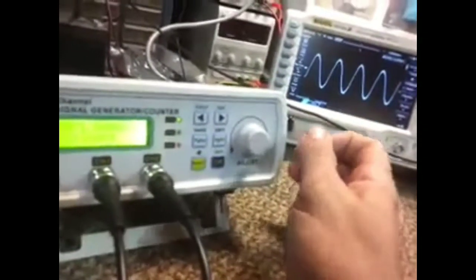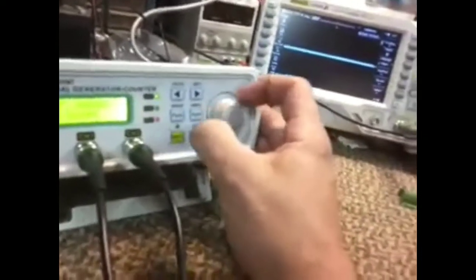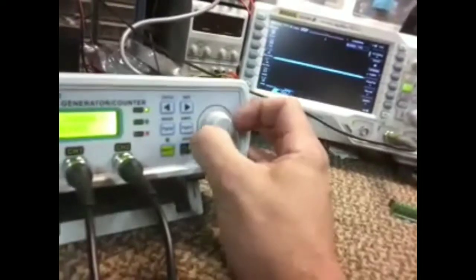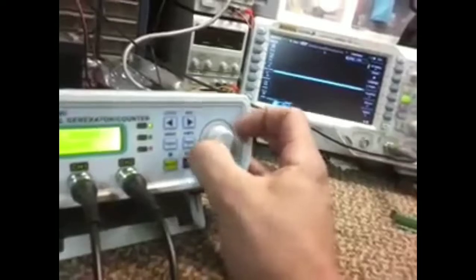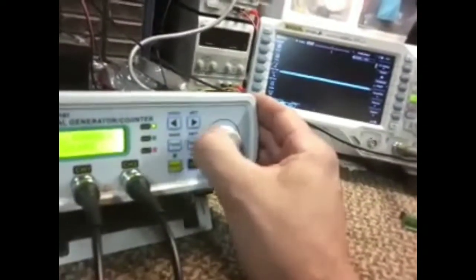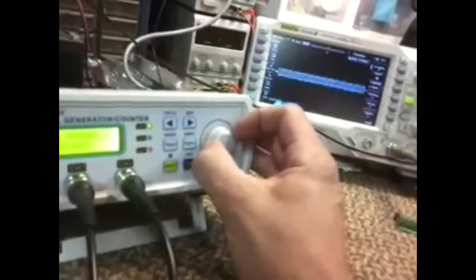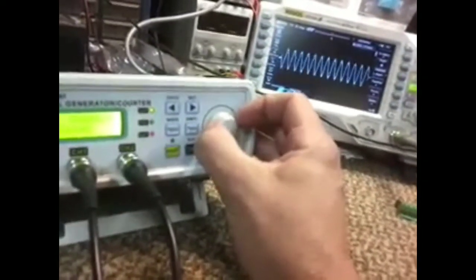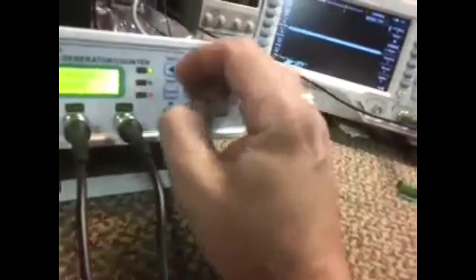Now, if you think music, and you go an octave above this, you'll be able to find its second resonant frequency, but it's not as strong. Let me just keep pushing, here it comes. You'll get a little bit more, probably around the 200 range here. Let me see when I get to it. You start seeing a little bit of a, there it is. Okay, this is its second resonant frequency. That happens to be 218 kilohertz. So basically that's what's going on.